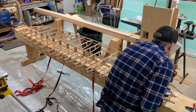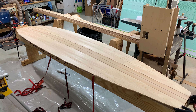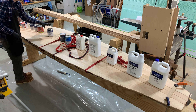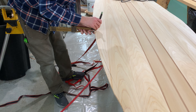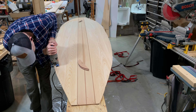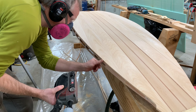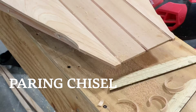This is Thixo from TotalBoat — it's just a two-part epoxy that comes in a caulking tube and it makes everything so easy. I can't recommend it enough. It's thickened, cures in like an hour or something, maybe a half hour if it's really warm. I just shot that on and was able to do this entire sheet as one big giant glue-up, which seemed to save time. I'm using a carpenter's folding rule to reference the rail to the top sheet, then a jigsaw to cut off most of the excess, then a little router and a belt sander and a paring chisel and a hand plane, and you're good.